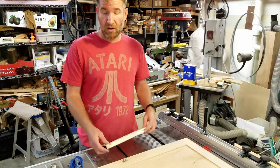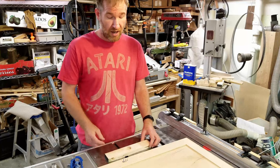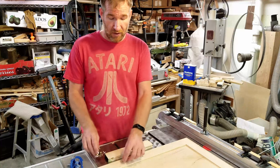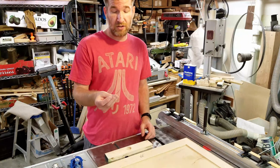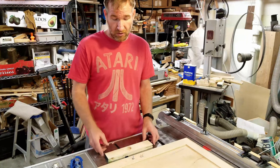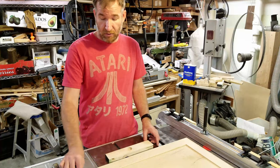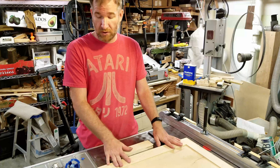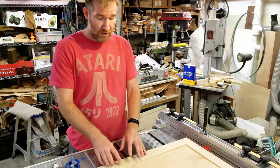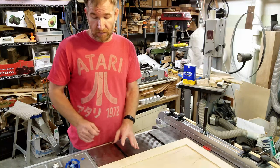If you want to see me tune all that in, check out my other video that covers using this jig. My hinges came with two screws for the hinge itself and a truss screw for the face frame. That larger screw requires a 1/8 inch pilot hole as opposed to the hinge screws that only require a 1/16 inch pilot hole. I like to pre-drill all these holes into my doors prior to painting or staining because when you're moving stuff around you might scuff up your paint or finish.